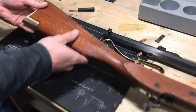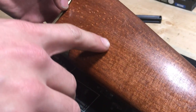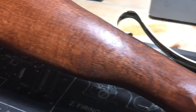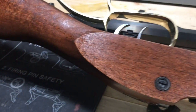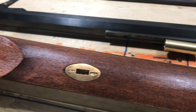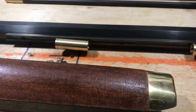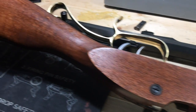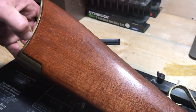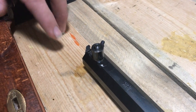One of the main things about the stock that I wish I'd seen earlier is that it's almost quarter-sawn — you can see very fine lines throughout the entire stock. I took my time sanding, probably a good 15 to 20 minutes, but I definitely should have spent more time on it. Once I got the stain on there, a couple coats, you could really see those lines. It could add character to the rifle, but I started sanding so it's a little patchy in some places.